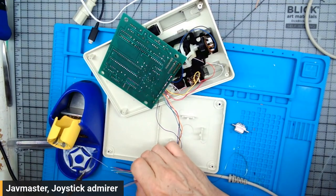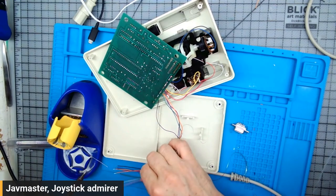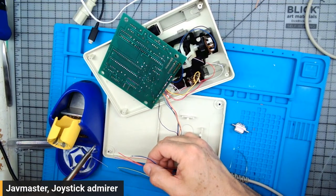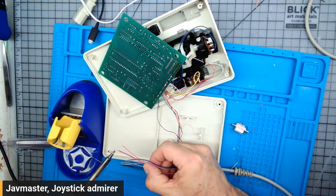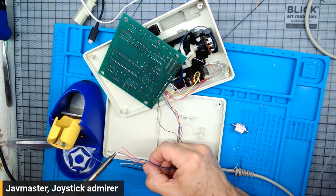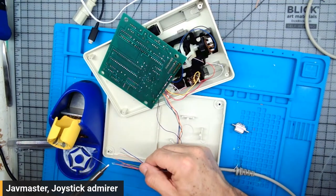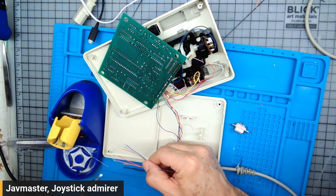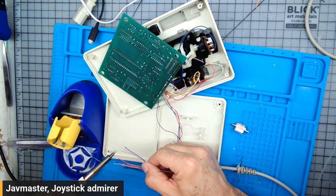So what we do is we put some solder in. I put some solder on the tips, so when I put them in, all the little hairs don't go all over the place, and it also helps soldering it. But sometimes I put too much, so I gotta take it out, and just a little bit, just enough so it doesn't make the little hairs go crazy on me, that I don't have any hair.